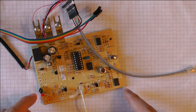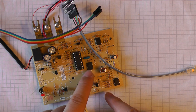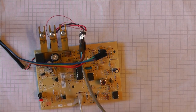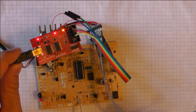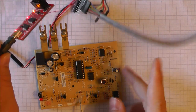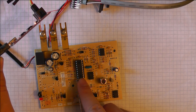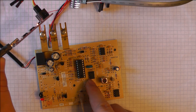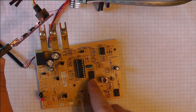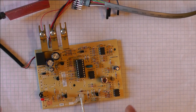Another feature is that whenever the device is powered on, it reads all the stored codes. The purpose is that when I attach a logic analyzer — here we use the Bus Pirate in I2C sniffer mode — I can sniff all the traffic between the microcontroller and the I2C ROM, and this way I can extract all codes recorded in memory.